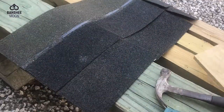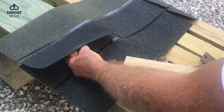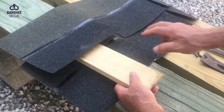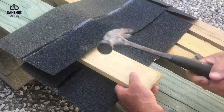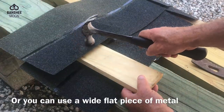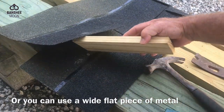Now let's take a look at the way I used to do it — the old school method. Put your nail where you want it, then take your wood and place it on the head of the nail. This way, when you strike the shingle with the hammer, you're not putting the force directly onto the nail which will come up through the shingle. You're spreading the force out onto this piece of wood, thus not damaging the shingle to get your nail in.